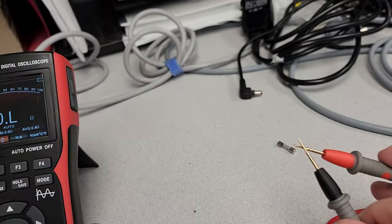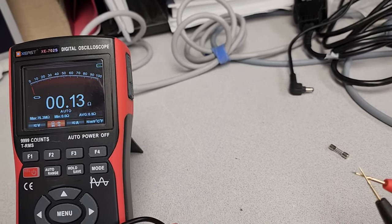Now you should always have as low as possible ohms across the fuse. If you use continuity mode to check fuses, it can be deceiving. Pop your meter over to ohms and wait for it to stabilize — your fuse should, unless it's corroded, have almost the same level of ohms as touching your meter leads together. It should be as close to zero as possible: 0.1 ohms, 0.2 ohms maybe. But if you're getting 1 ohm, 1.5 ohm, 2 ohms, 3 ohms — notice my meter did beep. It showed continuity because there was some sort of path of current from one probe to the other. And because I had continuity, I proceeded to tear this device apart when it was the fuses. I hope you learned something today, because I know I did — it bit me again. Thanks for watching, guys.